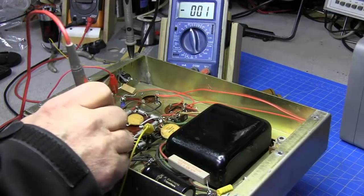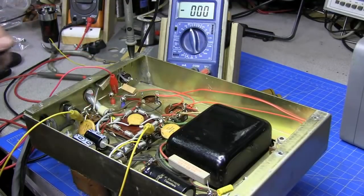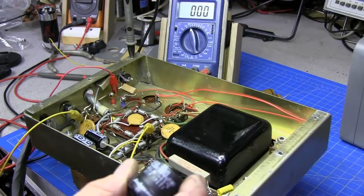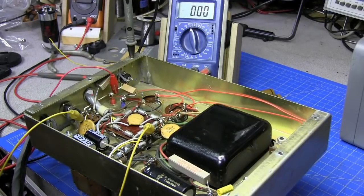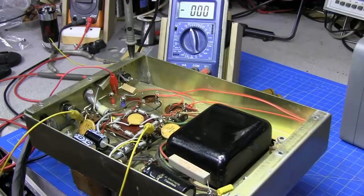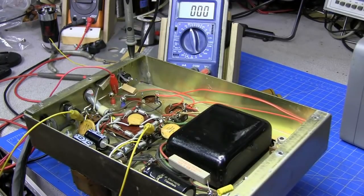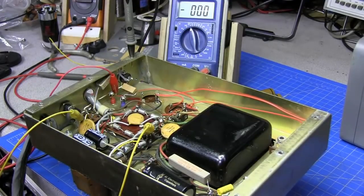Like I say, you want to get a little more voltage on it due to no load. So supply's looking good. We just got to figure out if I can find something in the shop to replace those with. Like I say, I don't really like putting that much in it. These are good caps. 900 volts should be enough. On the load, it should not go much over about 780 volts, maybe 790. But if it don't go no more than that, 450 volt caps will be fine, because that's 900 volts, and you're not pushing them. You're leaving a little over 100 volts there for some headroom.